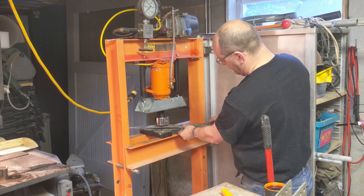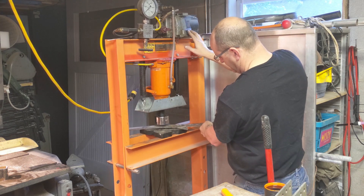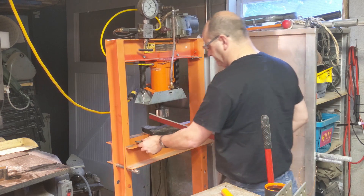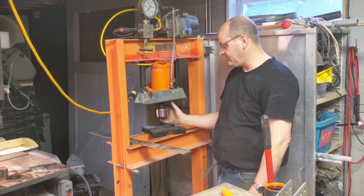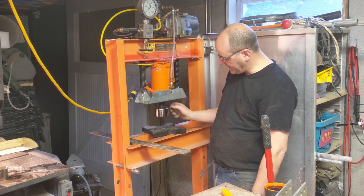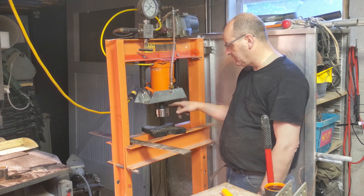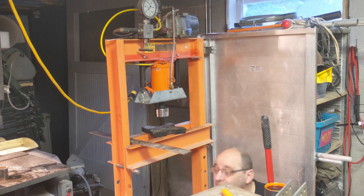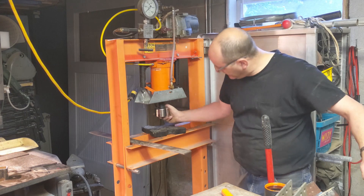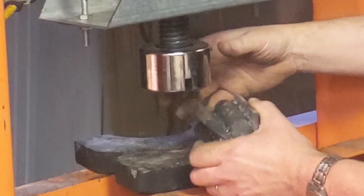Now we got this little bit of a bow — oh, that's much better. Now, you may have noticed this head. This is a cast-iron dumbbell weight that I bored to fit the jack pad, and then tapped a little hole for a quarter-twenty set screw. It's a real tight fit, so it barely falls off anyway. Then I stuck it in the mill and cut a 3/8-inch groove in it.